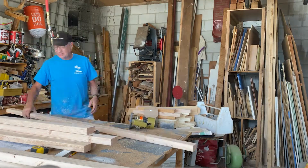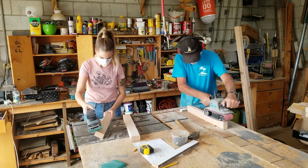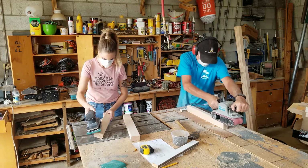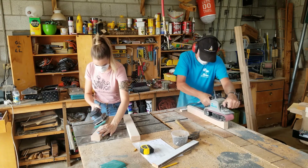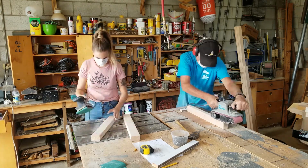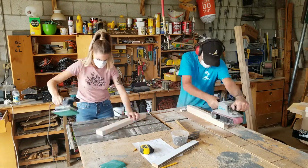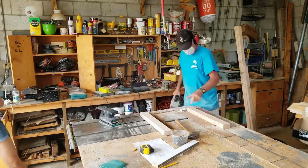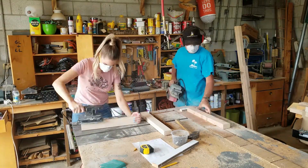No, she was. Now we need to sand it. Two steps in the sanding. One was a belt sander to really do the major work, because this is building lumber. It's rough. So we needed to use a belt sander, pretty heavy grit, I don't know, 80 grit or something like that, to smooth it down at first, and then you can use the vibrating sander.